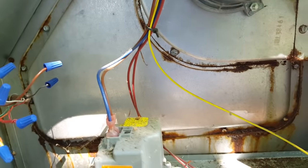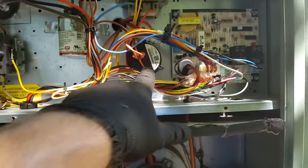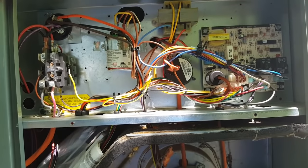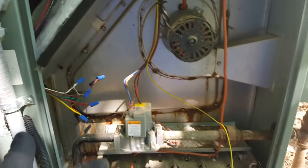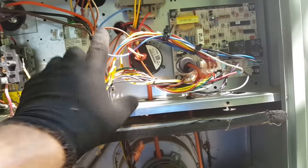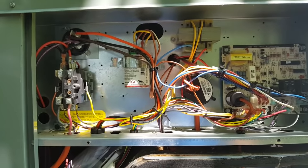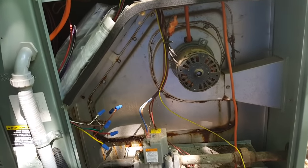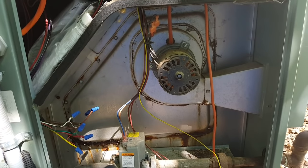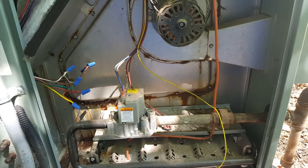The people inside were really concerned they'd have to replace the whole unit — it's only seven years old, but their concerns are valid. A few years ago when they first called me, there was a pressure switch issue, and there's still rust around the heat exchanger. I didn't see any holes in it, but it's a sad unit that should have lasted a lot longer. Most likely it's a ducting issue — I can see the CFM coming through the return and I'm pretty confident we're not pushing the air we should due to the static pressure.